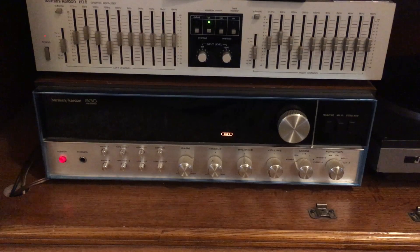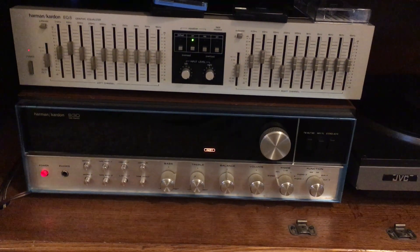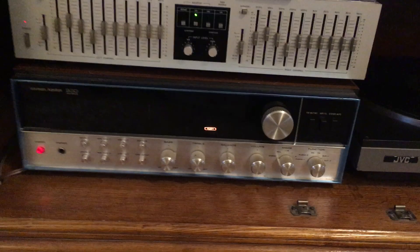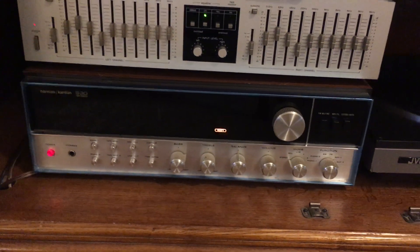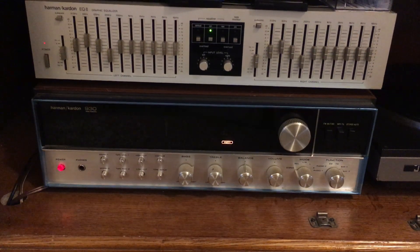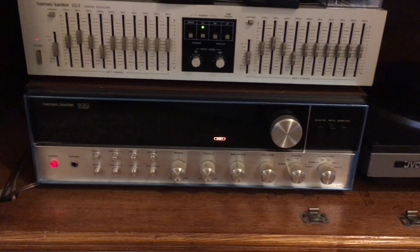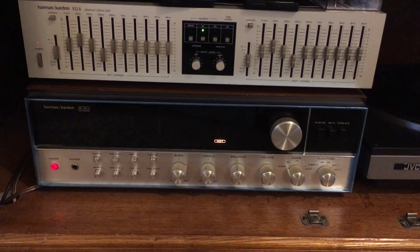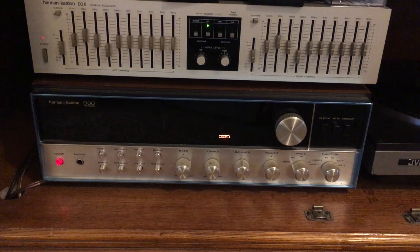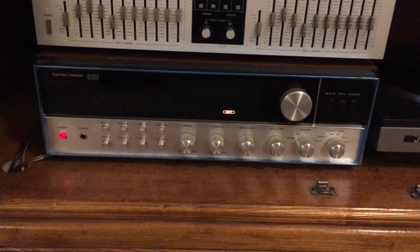I did do another modification. The phono section is a little phono board underneath the unit — you have to turn it upside down and take the bottom panel out. It's a four-transistor phono board. Some of the Marantzes at this time were six-transistor boards. Not sure why Harman Kardon did this — probably just fewer boost stages, better audio. I went ahead and took the transistors out and replaced them with NTE-199s. These are high-gain preamplifier transistors, probably developed in the '60s and further perfected in the '70s, and these give the phono section more bite to it — that's about the best way I can describe it. I love the sound. Those are the modifications I've made to this.